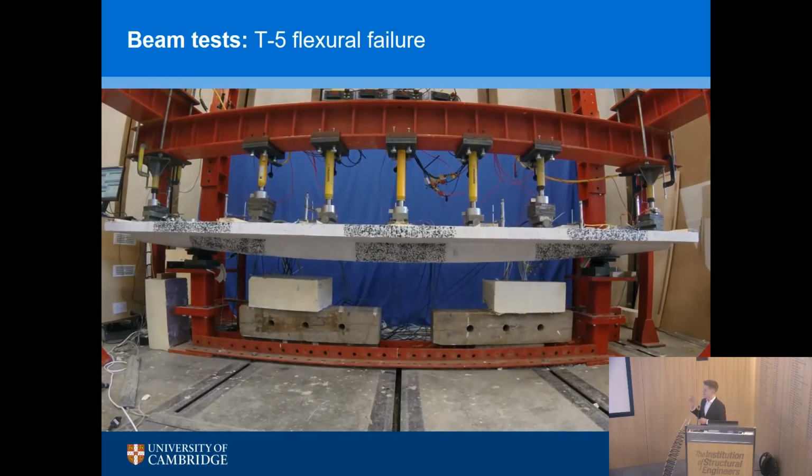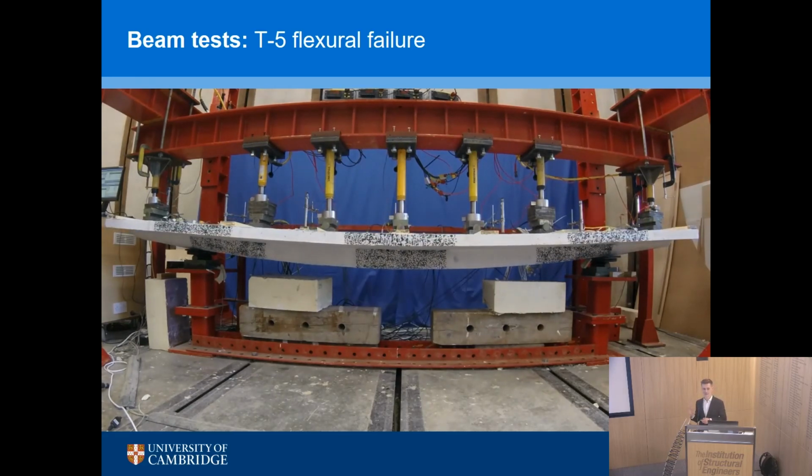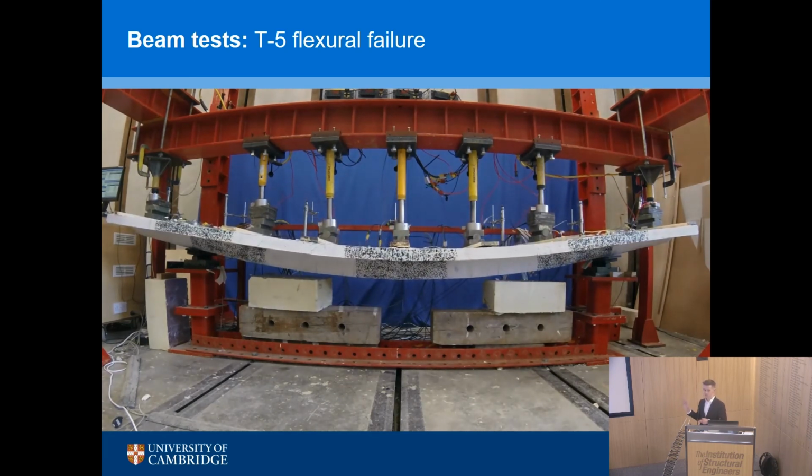and it's well beyond any serviceability criteria very quickly in this video, which is obviously speeded up. This is a hugely deformable beam. That's only 3 meter span, and we're getting up to 100 plus millimeters deflection in the center. This is with supposedly very brittle materials. We've got concrete, we've got FRP. Brittle materials, but nice deformable behavior. So we can achieve this, it is possible.